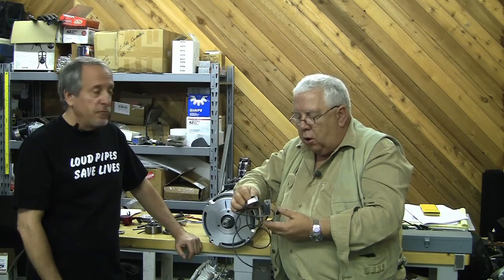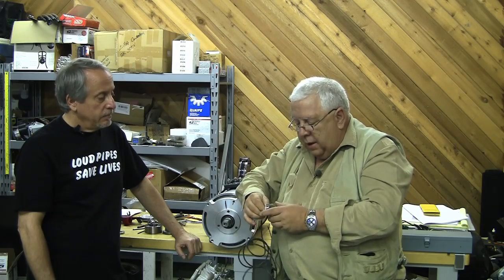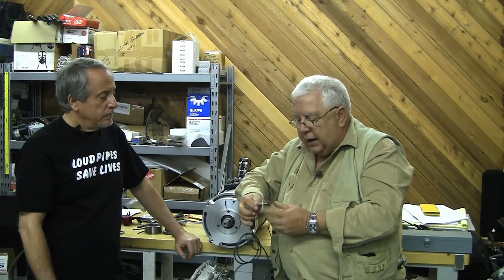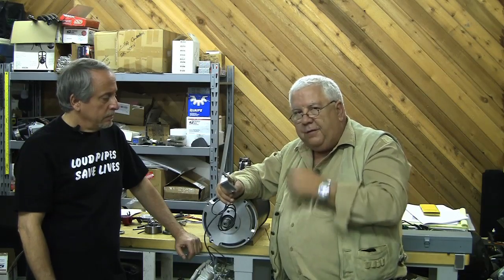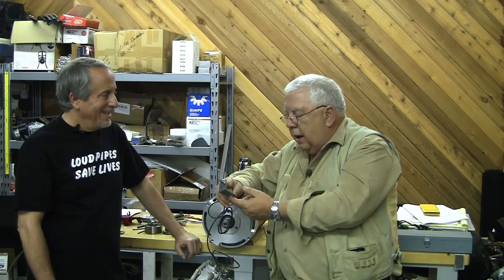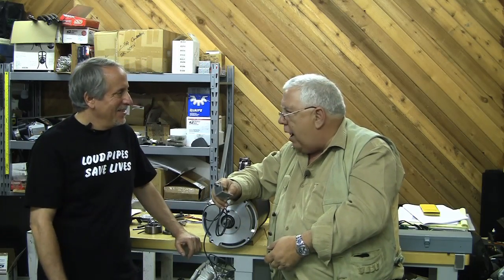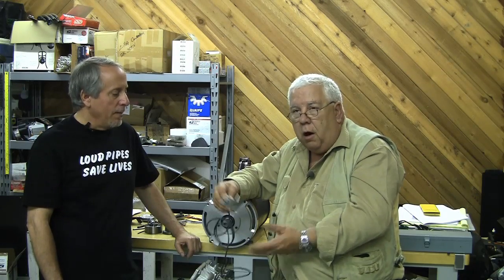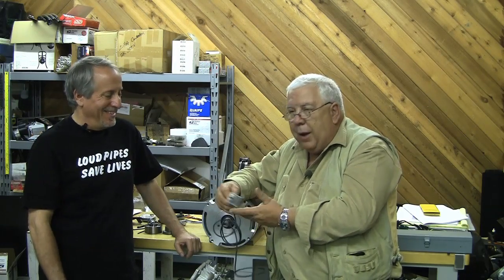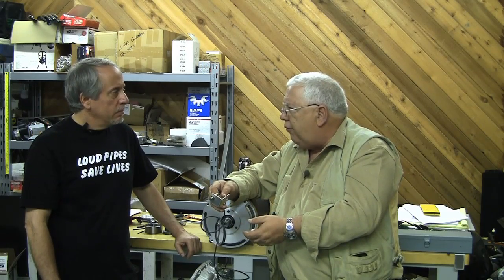The same one we used before — this is an automotive tachometer pickup. It's a magnetic pickup and it's threaded about an inch long. We've cut a hole in a piece of 6061 aluminum and another hole here. Our famous .090 6061 — if we ever run out of .090 6061, we won't be able to make anything. By the way, you can get plates of that on eBay.